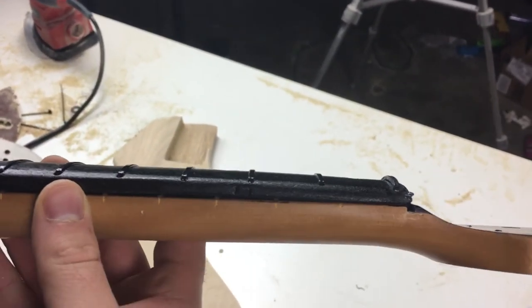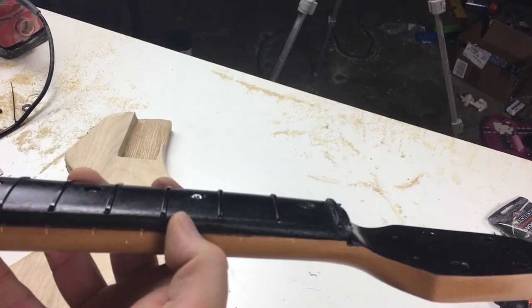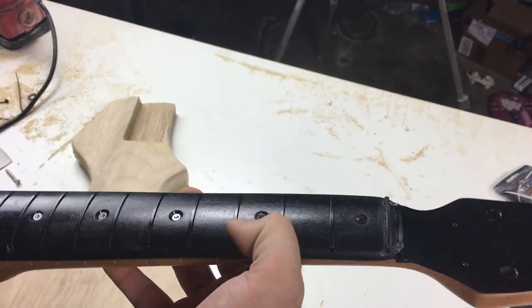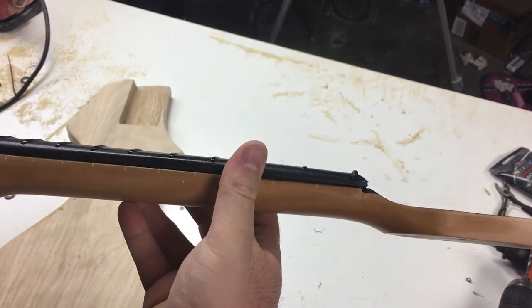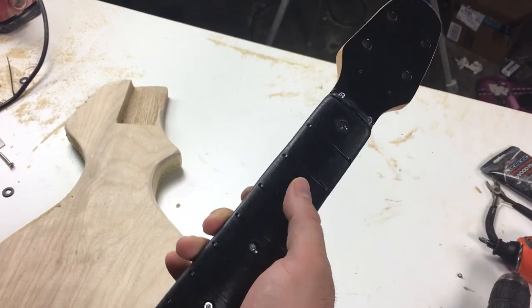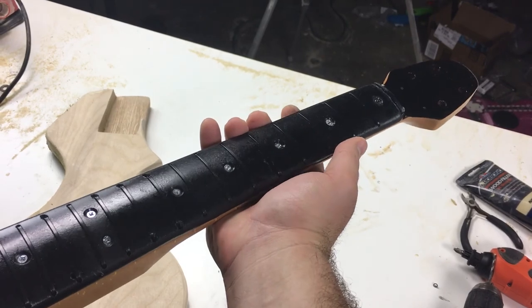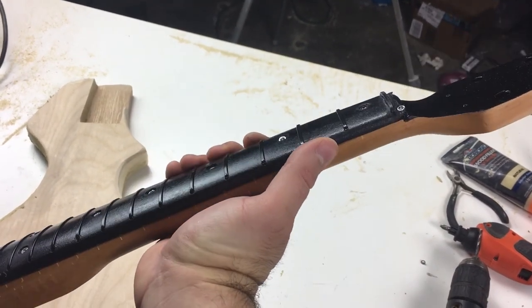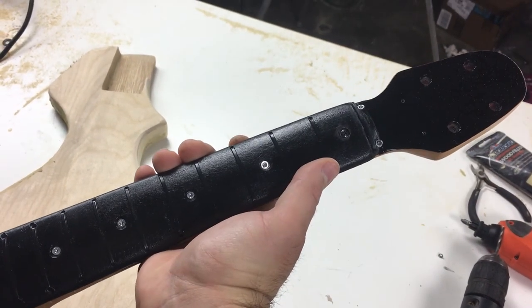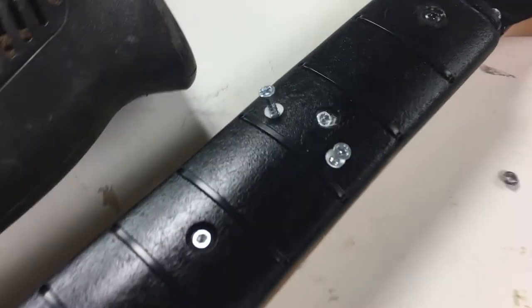Another neck tip. If you've got an area kind of bowing up with a hump and the screw you put in there just isn't cutting it, it's okay. It ain't illegal to put in a couple extra screw holes on either side of that thing to really push that section down with some extra force and hopefully flatten it out. And I'm just gonna cover them up so that they don't distract. So don't worry about modifying, correcting, adding stuff that you need to do. Just make it work. See, a couple extra screws. Ain't no big thing, we'll cover them up.